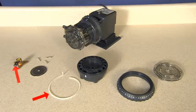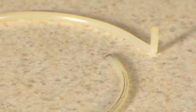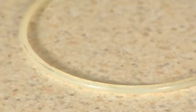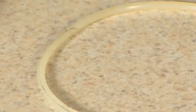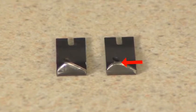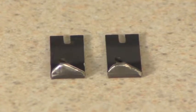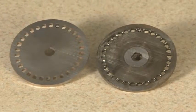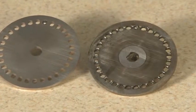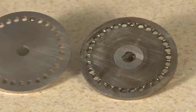The cam, index pin lifter, and index plate work together, and one influences the performance of the others. At the lower dial ring settings, a longer section of cam is exposed to the rotation of the lifter. The lifter continuously riding on the cam can wear a groove in it. If the rounded point on the lifter arm flattens from wear, from riding on the cam, it may not fully lift the pin out of the index plate. The pin will make a ratcheting sound from dragging across the plate. The feed rate control will index inconsistently at different settings. A worn cam and/or lifter can cause the index pin to drag across the index plate and elongate its holes. The pin will skip across the holes and cause index malfunction.